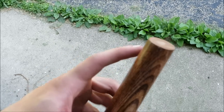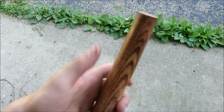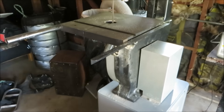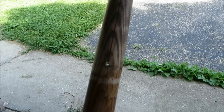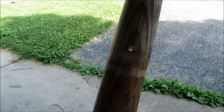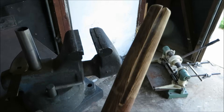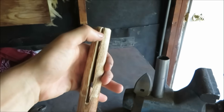I'm actually going to have to round out this end that I tapered, and also sand off a little bit of the polyurethane so that the epoxy can soak into the wood grain. Then once that's taken care of, you've got to cut a line down the middle of the stick for the blade to rest in — I'm going to use my band saw, but you can use a jigsaw or a hacksaw. Because the band saw blade isn't wide enough, I'll drill a hole the same diameter as the thickness of the blade, then cut two lines from the tip to the hole spaced the exact width of the blade. Then I'll mix up some epoxy, spread it onto the stripped part of the stick, slide the tube onto the stick, spread epoxy onto the tang of the blade, and tap the blade into the line.